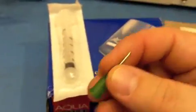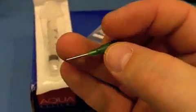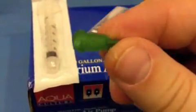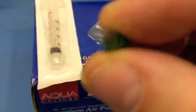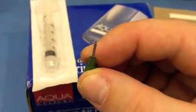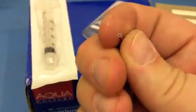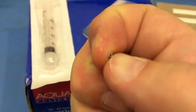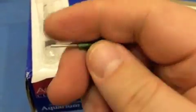I have a dispensing nozzle. This is with what they call a luer lock, so it should attach to a medical syringe, and this has a nozzle head size of about just less than one millimeter. Basically, the most important thing is that this is smaller than your smallest component, so if you use really, really small resistors, you need a really, really small dispensing head.